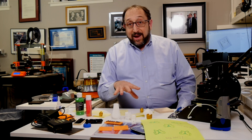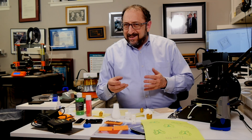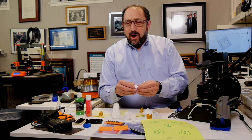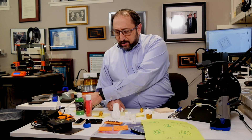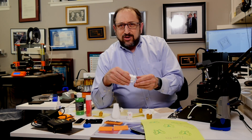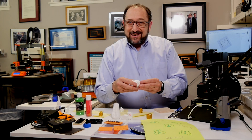I checked again with a brass nozzle and it was better. So I ordered a new Ruby nozzle for next-day delivery at my own expense — I figured I'd damaged it. I took the old one out and looked at it under a magnifying glass; it didn't look damaged. I put the new one in and it was better, but not as good as I was getting off my brass nozzle. Even the brass nozzle prints weren't great. I tried printing calibration cats, and they looked like they were under-extruding just a little bit between the layers.